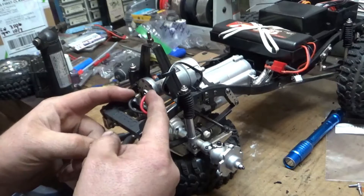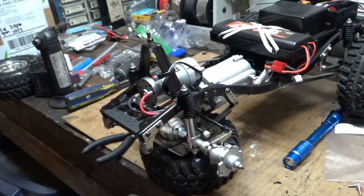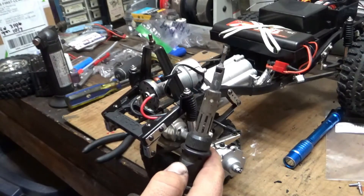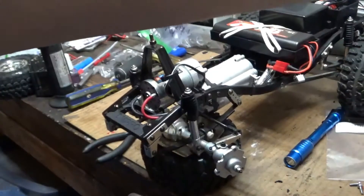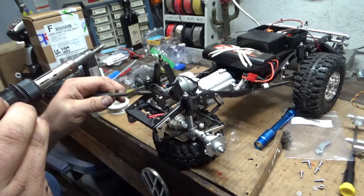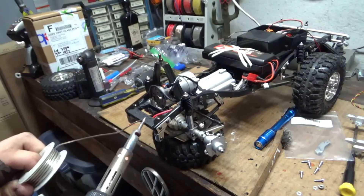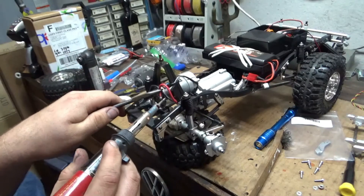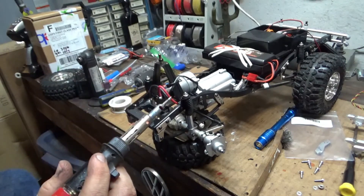I know I'm going to need to move these wires — point them up or point them down. I'm going to finish getting these screws in here and then we'll try to get the servo in. Now that that is completely secured, I'm going to use my butane soldering iron. I'll hold over here because the startup is quite obnoxious, especially on camera — so anybody who was wearing headphones, I apologize for that. Let's get a little bit of fresh solder on this one. The constant heating and cooling of solder will make it not work very well. Those are really nice solder joints, actually.